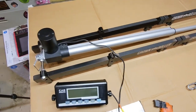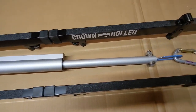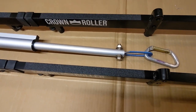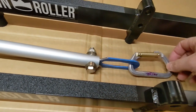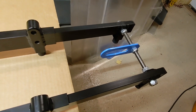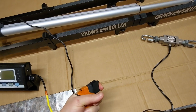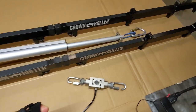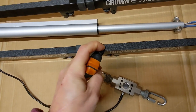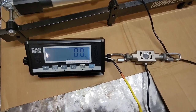Here you can see the jig I've got set up. I've got this linear motor here that basically slides in and out and can provide just shy of 500 kilograms of force. Bolted in this little metal bracket, I've got a way to connect it, and then there's another fixed end to connect to the load cell. To control the load cell I'm using this little bidirectional switch from a drill — you squeeze it to change the speed, it moves very slowly but has a lot of force, and you can flick the switch to easily change direction.